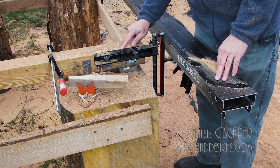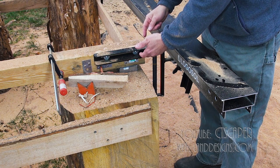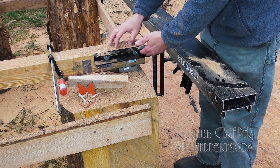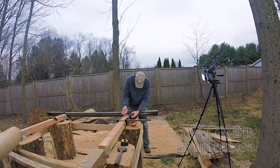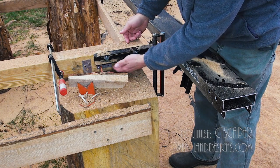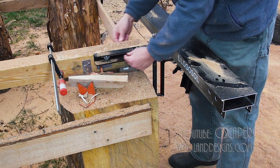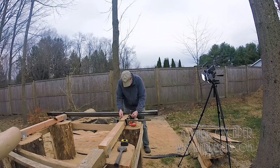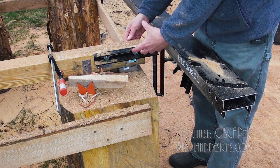If you take a look over here, this is how I ended up mounting the Big Mill Basic on top of my boards. What you end up doing is you remove the handles that attach the log, and you basically put a couple of pieces — there are a couple of metal plates under here. So if I wanted to take this off, I could just take out two bolts on either side. First you would take off the rail, then take off these two bolts and you could take the whole piece off and bring it inside.